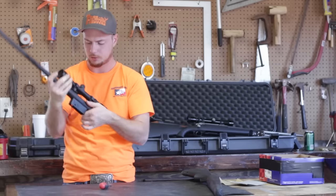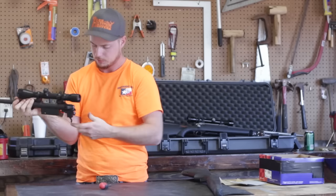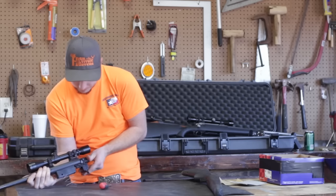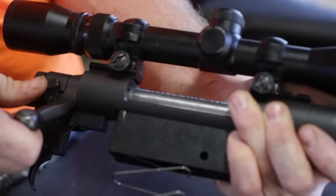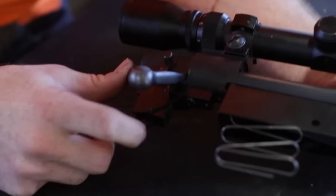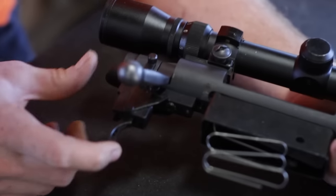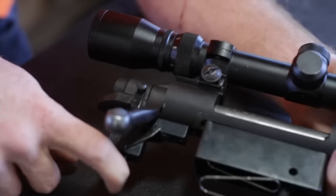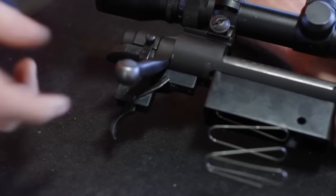Alright, so we got it flush — that's going to make the trigger a little bit crisper. You can feel it. I like that a little bit. There's not a whole lot of difference, but it is noticeable. What is neat on these triggers — the safety feature: it works as a set where if the trigger is bumped without pushing that middle lever, it just locks down and it won't shoot. You work the bolt again and then it works just fine. The lighter trigger means there's less of a chance of you pulling to the side when you shoot.